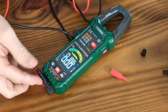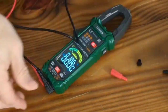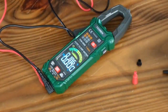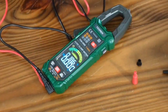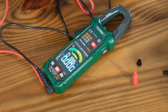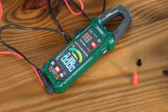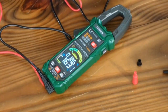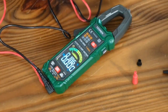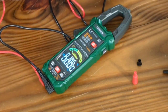I've installed my two probes — you pull this piece off the bottom and they slide in. I've also removed the caps to have more room to operate. To check volts in a wall socket you plug both probes in looking for 120 volts. Using a battery here, we'll see if this battery is still good — it reads 1.631 volts. It's a double-A battery and that's what it should have, so it's good.